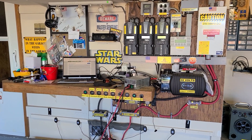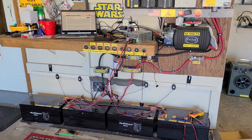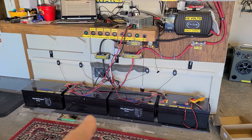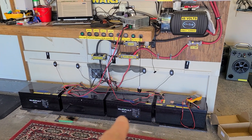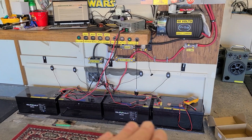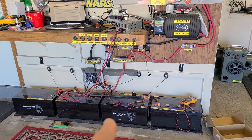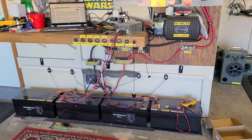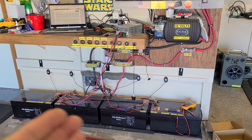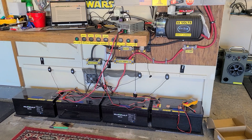What got me curious is what's going on with these batteries. Each one had a different state of charge — this one went into voltage overload, fully charged supposedly, the whole bank going up to 15.5 volts while the others stayed below. You look at the state of charge and all four of them are different.